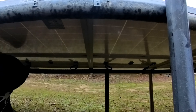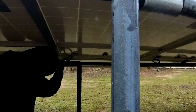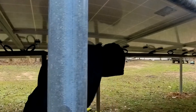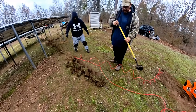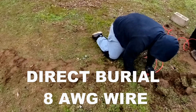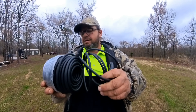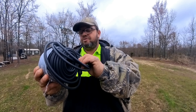Underneath here we are wiring these solar panels positive to negative and positive to negative. It makes it really easy and saves on wire — you don't really have to run any wire under here; one panel just runs to the next. Here's our 8 gauge negative wire. I'll leave a link in the description for this wire — it ran about $170 for 200 feet.